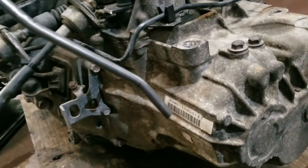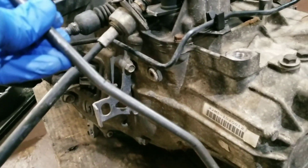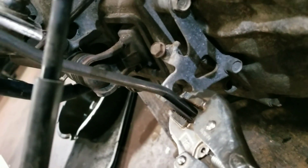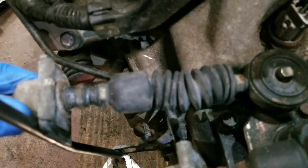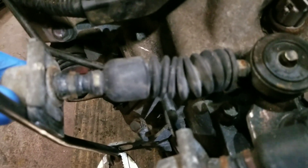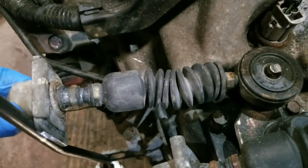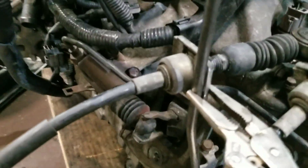I bent it right there and then up here just a very slight bend. I just have it vice gripped on there - I didn't tack it yet. I'm gonna weld it in place, make some measurements to make sure it's close to where it needs to be, make sure the shifter box is still centered, and then I'll tack weld it and start with another bracket.